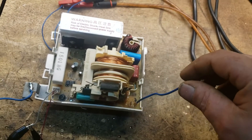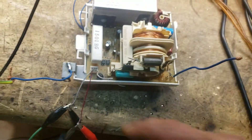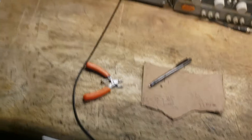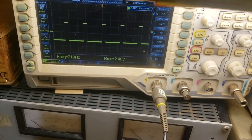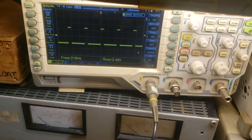This is a high voltage output — it's a negative high voltage. These two connections are for the filament and the negative output, and this is ground. The signals involved are a 5-volt square wave with a duty cycle — I think you can run it up to around 80%, but it has to start really low; I think it was less than 30%.